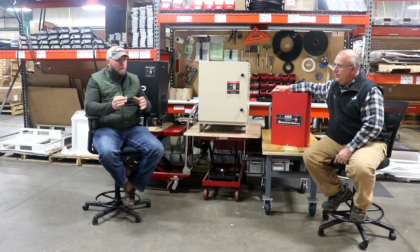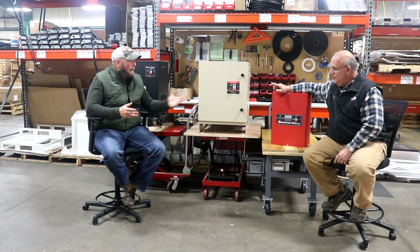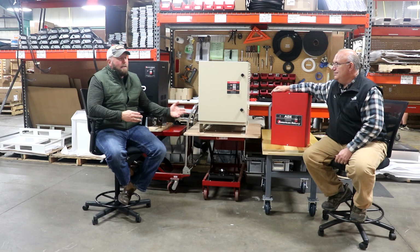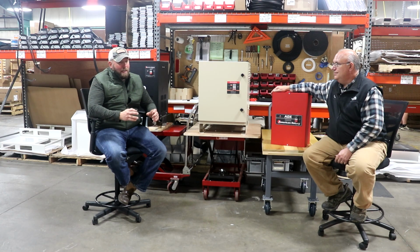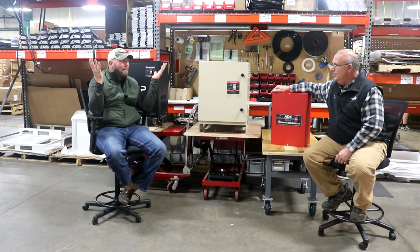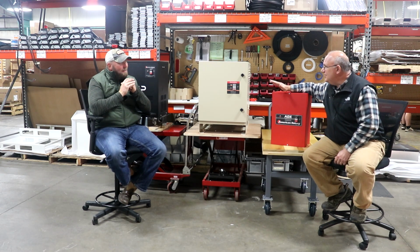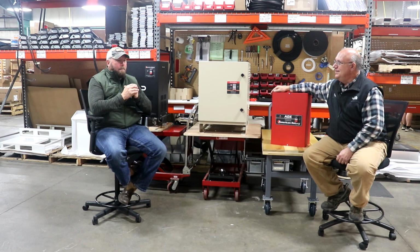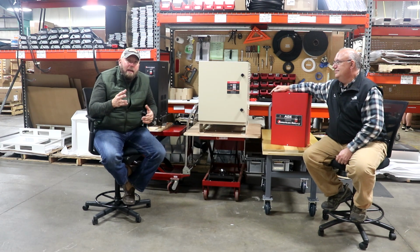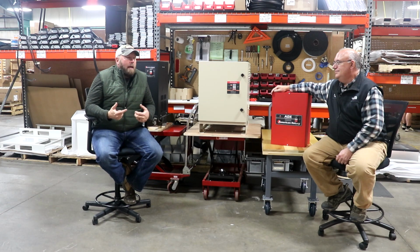And it's going to be, they're typically sized for that piece of equipment. Correct. Yes. And a VFD, you still have to go 2 times the size. Listen, a VFD was not designed, the functionality of it was really not to make 3-phase power. It's designed to vary the frequency of the power, right? Exactly. Variable speed. One of the other big things that I like to talk about with VFDs is that a VFD is going to have a lot of harmonics.